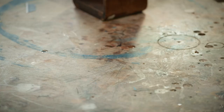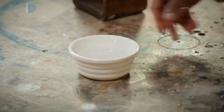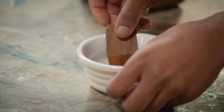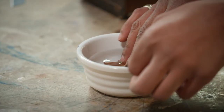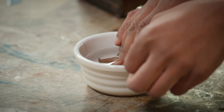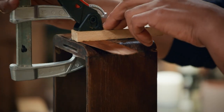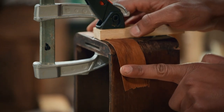So I'm going to use a small pot of warm water. The idea here is that you soak the veneer. And already I can feel it's starting to soften up. I'm going to now clamp that in place around that curved edge and leave it to dry. Once it has, it should dry in the exact same shape that I need it to.